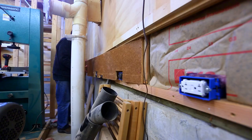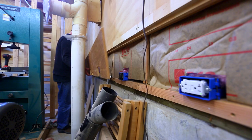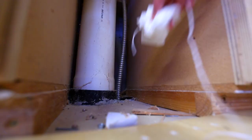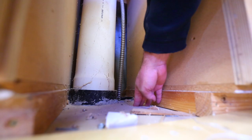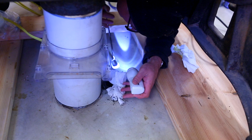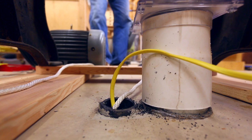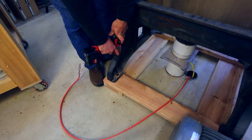The sander was also going to need power, so I needed to run a wire from the wall into the center of the shop. I have a three-inch pipe cast in the floor to run wires in. The first thing to do is tie a paper towel to the end of a string, then use the shop vac to suck that paper towel through the three-inch pipe. Then I can fish the paper towel out the other end, get the string through, use that to pull a rope through, and then use the rope to pull the actual wire through the pipe - a big number ten four-wire cable.